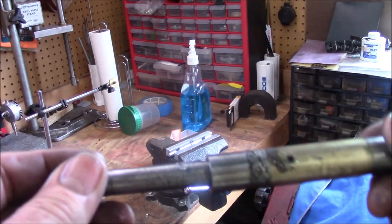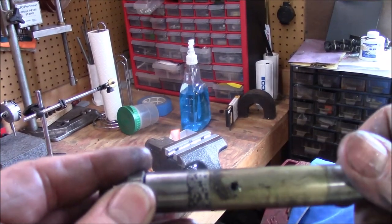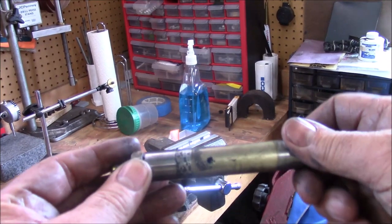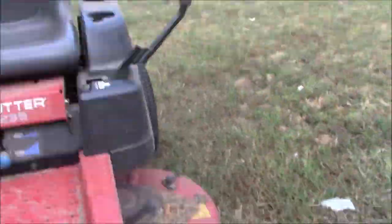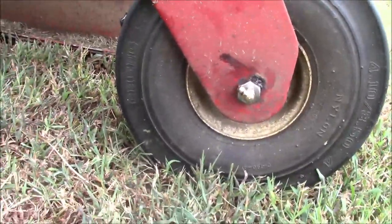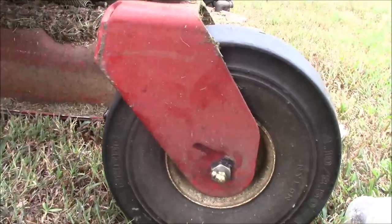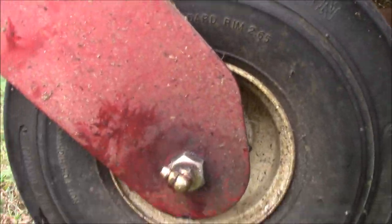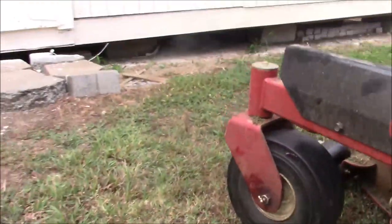Forgot to turn the camera off. So now I've got this drilled — I drilled the bushings so they line up this way, to put grease in there. Let's go put it on. This is handheld and outside. This is my mower, and right there is what the finished product looks like — where I can get to them. I don't know if you can see the original grease fitting here — it's up in here on the wheel. And you can see on both of these wheels, it is damn near impossible to grease this thing unless you take the wheels off.